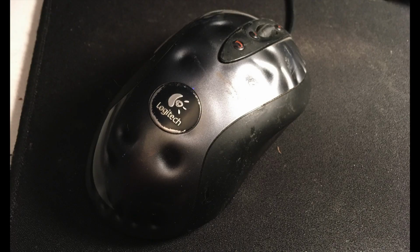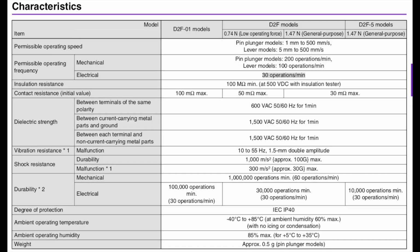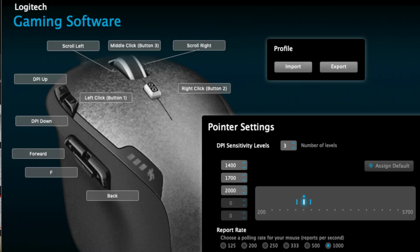So where does that leave us? What does that tell us? Well, as the end user is stuck in a situation, we got a couple options. We can take them out and put the Japanese switches in there or something similar, but these aren't rated at gaming specifications anyway. They're just rated for the electrical loads, so they do have 3 times or more the electrical life of the regular D2F models, but that doesn't necessarily mean that they're going to hold up better under being mashed.